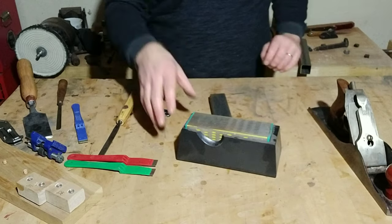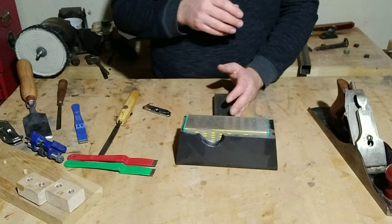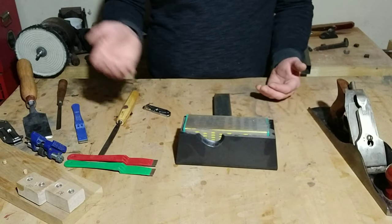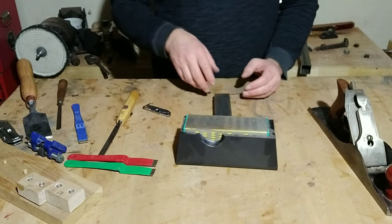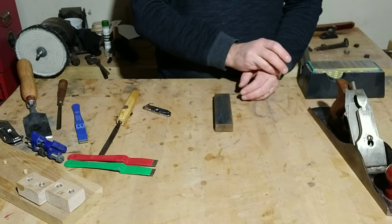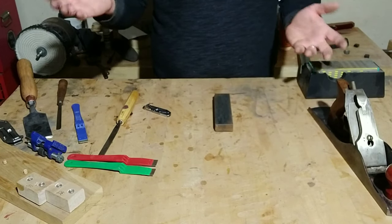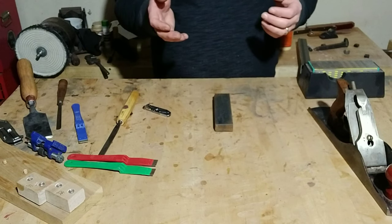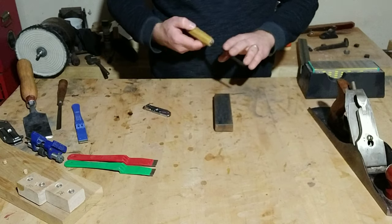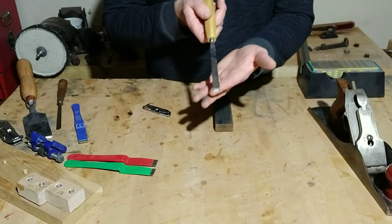The two compounds I use when sharpening: water is one of the best options — it's cheap, easy to come by, and you just fill a bowl and continually wet your stone. The other compound that helps in the polishing process is a window cleaner like Windex. I've used that plenty of times, but primarily I just use water. I will use window cleaner when I'm on a high-polish stone just to get a nice shine on the end of the bevel.